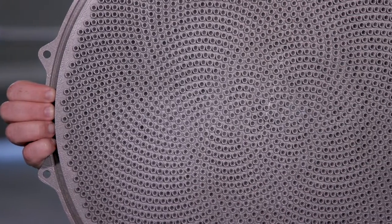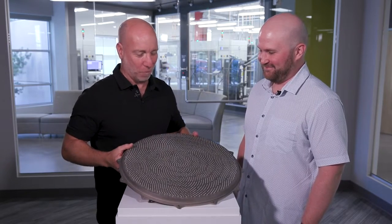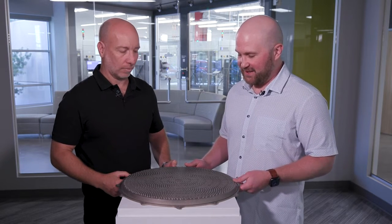This must be one of the biggest and heaviest metal 3D printed parts I've ever seen — this literally weighs a ton, like 30 or 40 pounds at least. And how big is it? This is about 400 millimeter diameter. This is a shower head for semiconductor manufacturing on the deposition side, and it was printed on our DMP Factory 500 in Inconel 718.